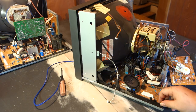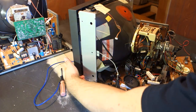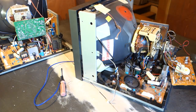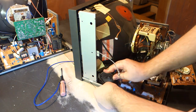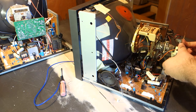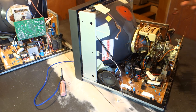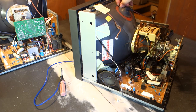From there, it was simply a matter of lifting the tray slightly to make it over the risers in the metal, and getting it past the degaussing coil, and it slipped right back into place. If in properly, the plastic tray should be resting entirely within the metal base, and the buttons on the front should give an obvious clicking sound of them properly triggering.